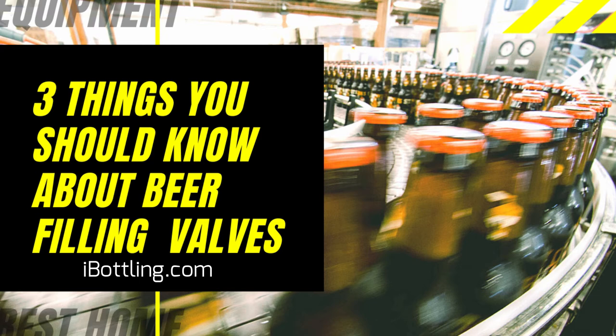Different Vacuuming Methods. The mechanical filling valve adds a control valve on the vacuum channel and a pressure block on the centering ring. When a bottle lifts the centering ring, its pressing block presses the control valve's stem, then opens the vacuum valve to vacuum the bottle. Otherwise, it cannot be vacuumed and cannot reduce the load of the vacuum pump. The electronic filling valve uses an electric eye to sense the presence of a bottle to determine the control of the diaphragm valve switch, and then realizes the vacuum function.